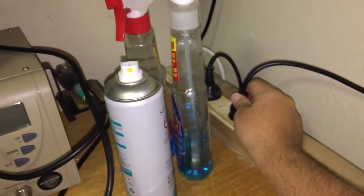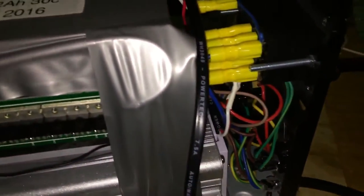The charger is doing its job. Now we'll simulate a power strike — power goes off. The printer is unaffected because this relay just clicked and it's now running off the battery.